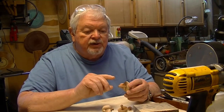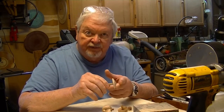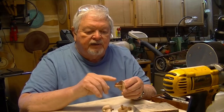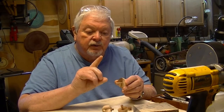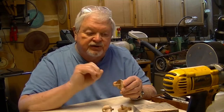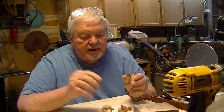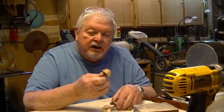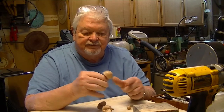So for instance, what we're going to do is we're going to make cuts that utilize the V cut, which we've known. We've done a planing cut, but we're going to do some other cuts that you haven't seen yet. We're going to do a peel cut to reduce this diameter. We're going to do some facing cuts to clean this up here, and spend a lot of time doing beads. So what we're going to do is take a few pieces of junk wood, go to the lathe.